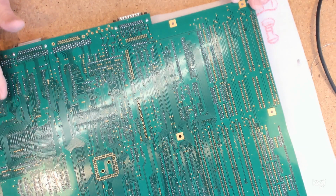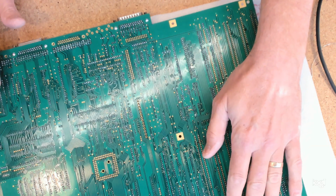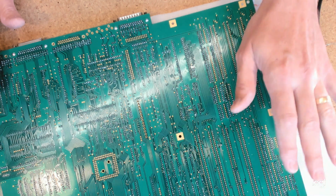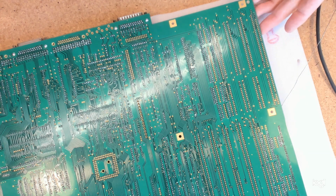I've done this edge over here, this is a video slot. The Zorro slot pins are relatively long. I may have to trim all of those, I think. That's what John Hertel's guide says he did, from memory, but if you're interested you should read his work and not my digest of it. It's compulsory reading, I think, for a project like this.